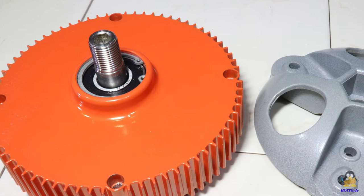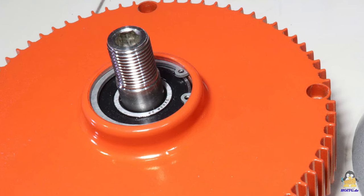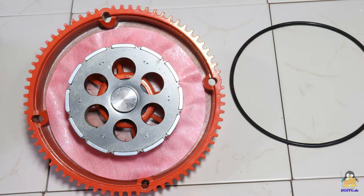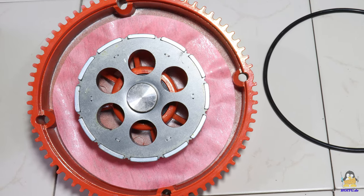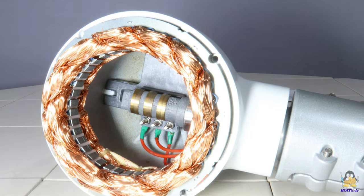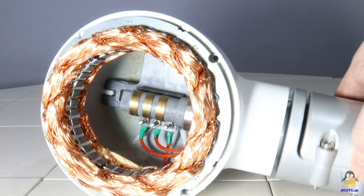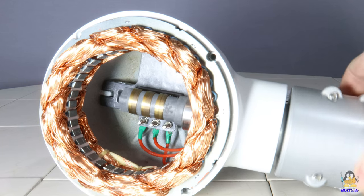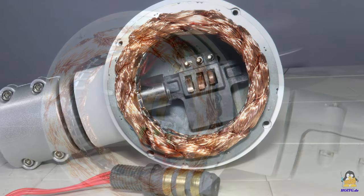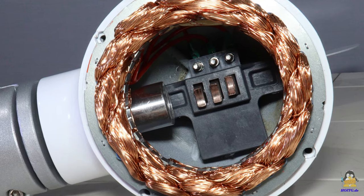The front part of the turbine with the rotor is attached to the housing with four 5mm screws. The rotor shaft is pressed into a bearing with two rows of balls, type 3203B, at the front part of the housing. A rubber ring seals the two components. Twelve permanent magnets are attached to the rotor. The coils wound with copper wire are located on the stator of the turbine, and the iron core is press-fitted into the housing. Since the turbine housing has to rotate to optimally align the rotor with the wind direction, there are three sliding contacts at the upper end of the axis. These are composed of press rings with carbon brushes and forward the generated energy to the outside via three cables in the center of the axis.